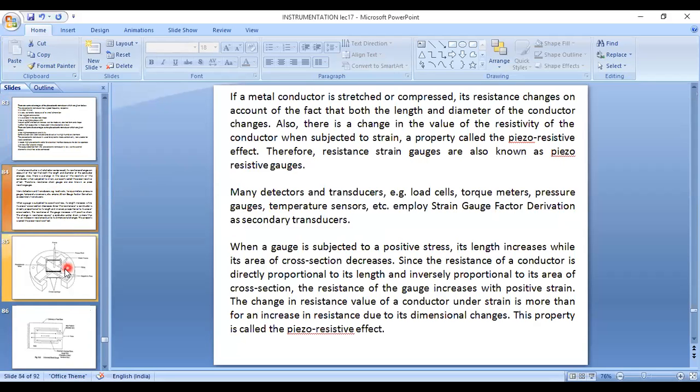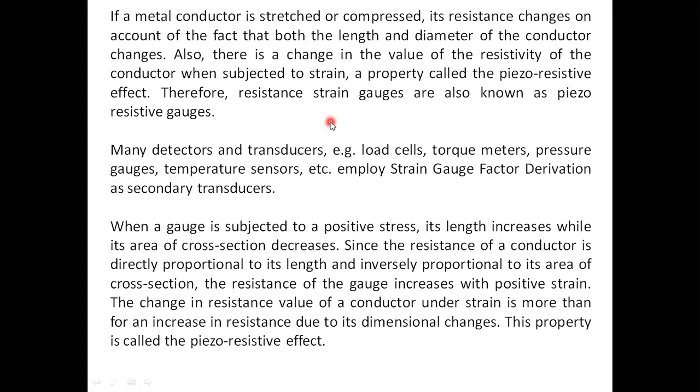Generally, strain gauges are of two types, okay, three types mostly. So the first one is the unbonded metal wire strain gauge. The second one is the bonded metal wire strain gauge. And in this type, there is another thing called the bonded metal foil strain gauge. The next one is sputter deposited or diffusion type strain gauges. The next one is the semiconductor strain gauge.